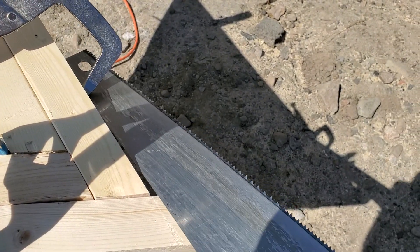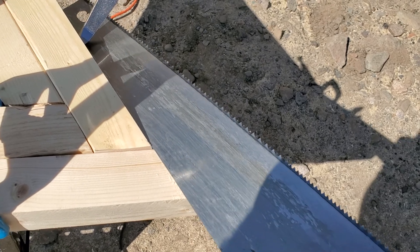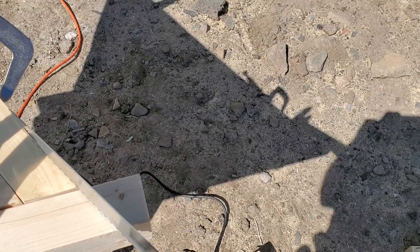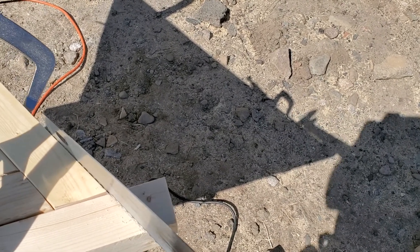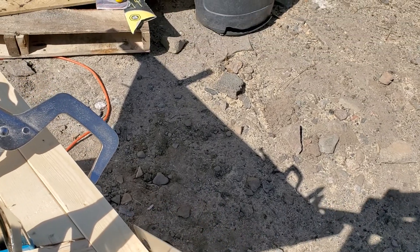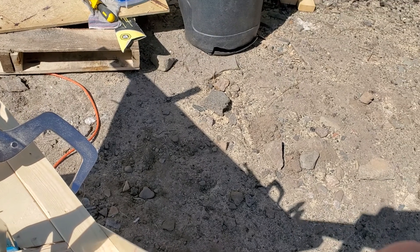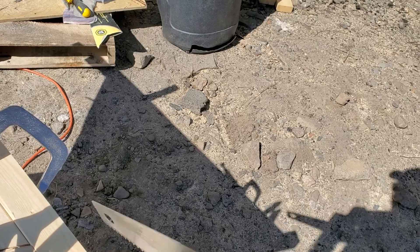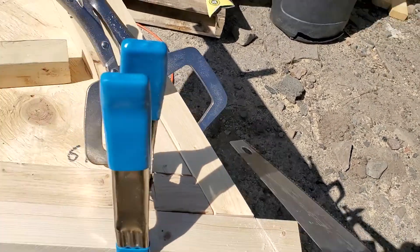That's a tip from Paul Robinson's video. As you're doing it, if you offer the back of your saw blade up, you can see the nice line going there. So I'll angle that — it's hard to do with one hand. Kind of like this, and then as I go down — and of course I should have the screw in to do that — as I'm making that angled cut, that's my guide for the saw to go out at the end of it. I should have a nice flush cut.